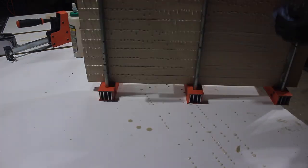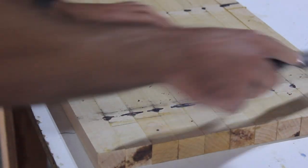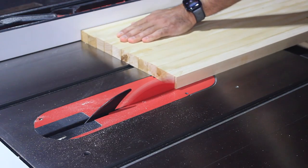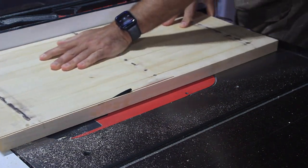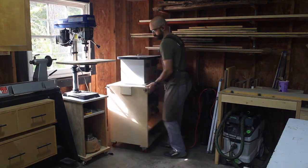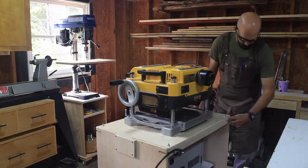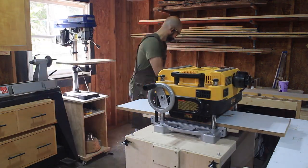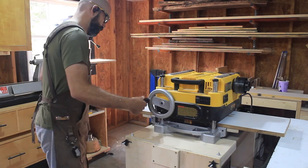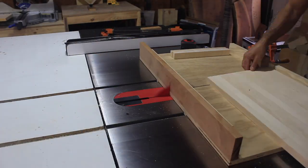You can totally spray it and then clean it off with rags. I came back with a chisel just to get a couple of those little raised nubs, then it was off to the table saw to get it cut down to size for the planer — just have to get under 12.5 inches to make sure it's under capacity with a little bit of room. The planer is where I get my first reference edge for the next glue-up. I used my flip-top tool cart, which I got the design from Spence Lee Design Co.